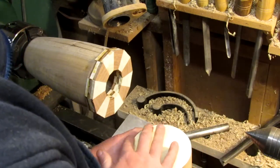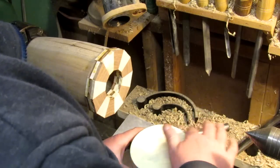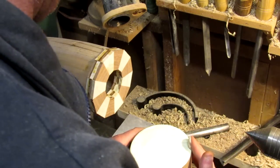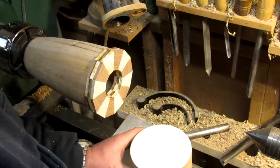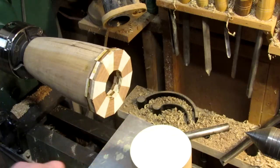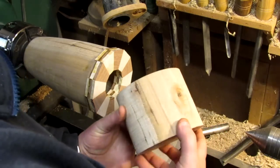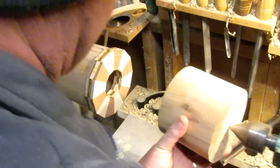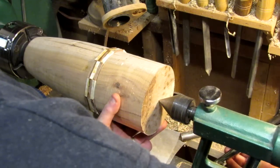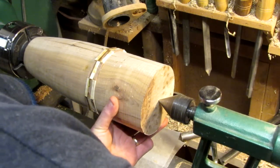And remember, this is end grain. That's what I was about to say a while ago when my battery died. This is end grain. You have to get plenty of glue in there, because the end grain is going to soak it up. And that's why a lot of your end grain glue-ups end up failing, because the glue all soaks into the end grain. Alright, so I'm looking at it right about here. Let me pull this up, get this in my... line the grain up.